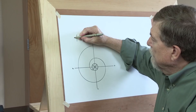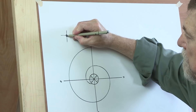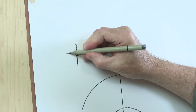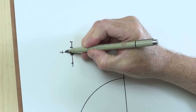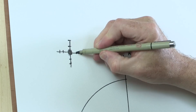We start with a vertical and a horizontal, and we'll draw a little eye in there — maybe something the size of a dime. I also want to put a reference point in here where the volute starts; that's the outer limit of the volute. Judging by eye, I make four other marks about the same distance out. These are just references to help guide those quarter circles as they dive in. I also like to make another reference line halfway in — these are just reference lines to help guide your little quarter circles.